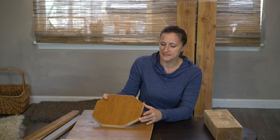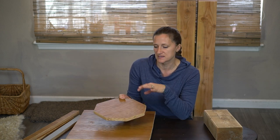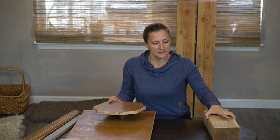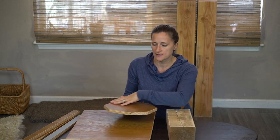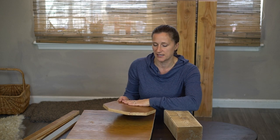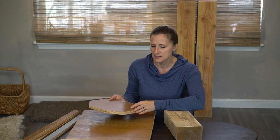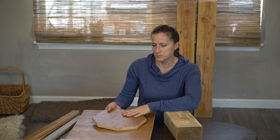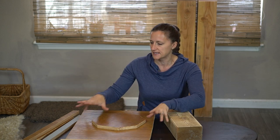For my plywood pieces I actually repurposed some cabinet backing, so it's got a little bit of stain on it already, but that's fine. These ones are not going to get any stain — I'm just going to polyurethane them — and for this one I will go ahead and do a dark ebony stain so that there's some color difference between the posts and these pieces. I've sanded everything down a little bit so that it'll take stain better.